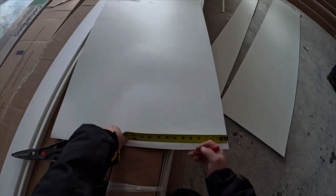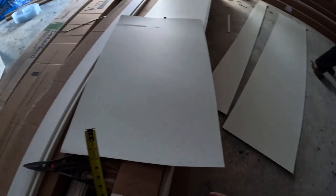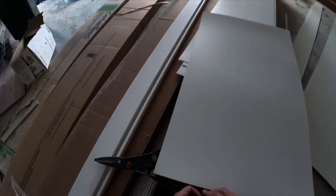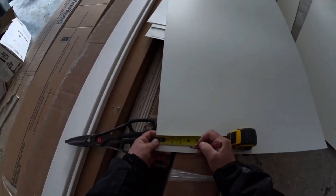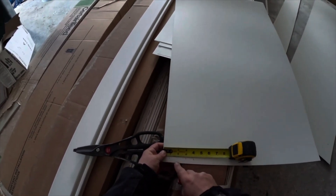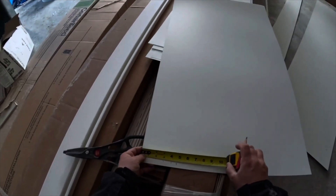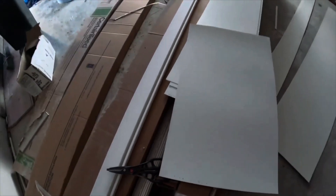So we go six inches, then it needs to come all the way back the other way — about nine inches total, so you can get by with a nine inch piece. I'll mark the same thing on this side: seven eighths for the hem, two and seven eighths for the face, coming back an inch to the middle at three and seven eighths, then five eighths again at four and a half. We need an inch and a half back, so nine inches is where I'm going to cut.